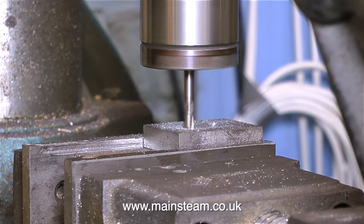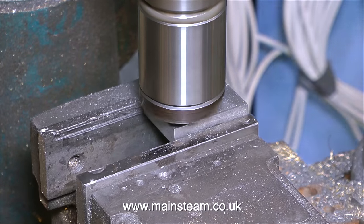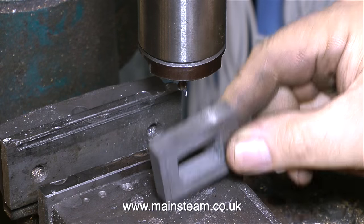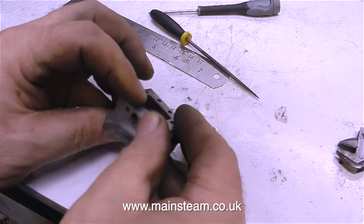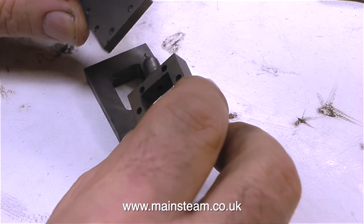In the previous clips I've shown how I fit this smaller diameter milling cutter into the chuck. The reason for this is just to clean out the inside of the steam chest. Normally I wouldn't bother using a milling cutter to clean out the inside edge of a steam chest — I'd just use a file — but I have to on this one, because there was a piece of cast iron across about a third of the casting, which is obviously something to do with the design of the steeple engine.